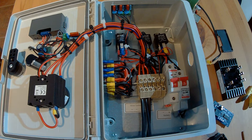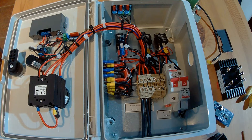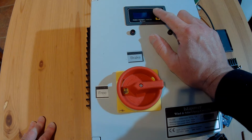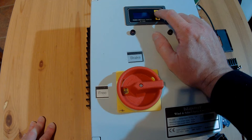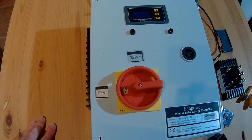You're now able to charge lithium iron phosphate batteries. I'm doing this with my 24 volt version and my 48 volt version — the 48 volt 2000 watt version charges my lithium iron phosphate battery pack perfectly with this cheap charge controller, because I had the opportunity to change the minimum and maximum output voltages. For the 24 volt version, it was blocked at 28 volts, which is a bit too low for lithium iron phosphate. The 48 volt version was blocked at 50 volts, so I increased it to 52–53 volts, and now it works perfectly with my lithium iron phosphate batteries.